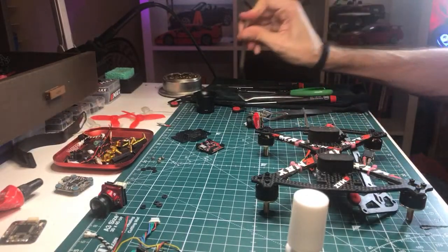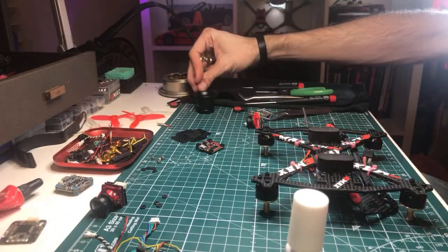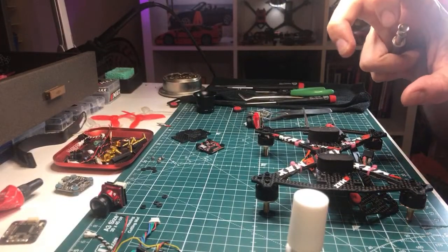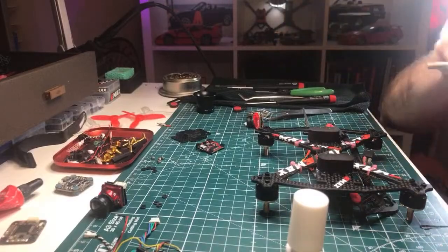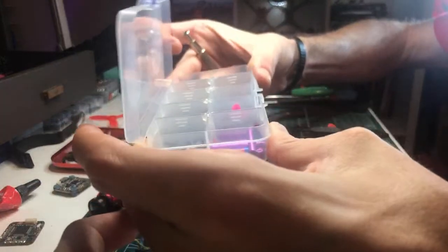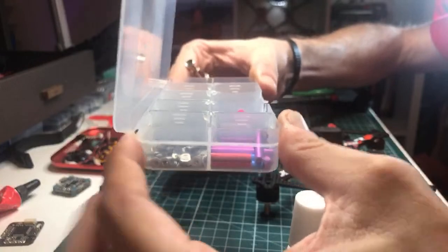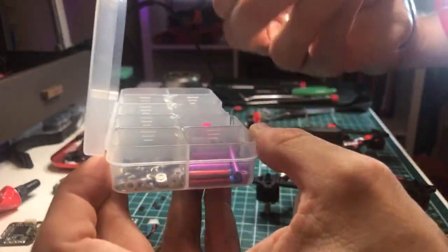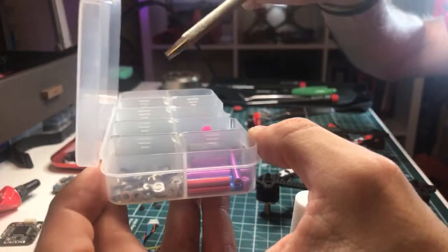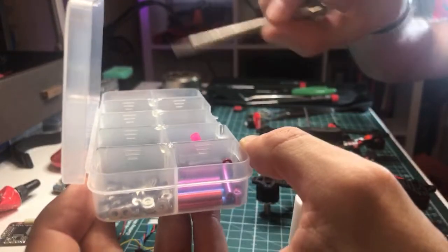The alien style frames have something going for them in terms of stiffness, in that the vertical standoffs box the center section of the frame in. Take a shoebox, take the lid off, and bend it like this, right? This is really easy because there's no top on the box. It's like a bathtub or a convertible. When people talk about why convertibles are so floppy, this is why. The soft top doesn't give any real stability. A convertible is like a shoebox with the lid off.